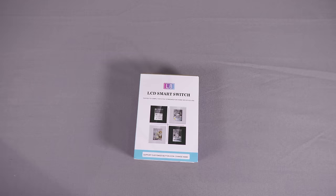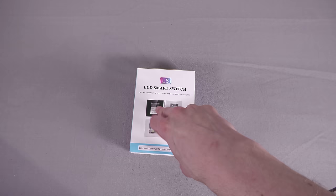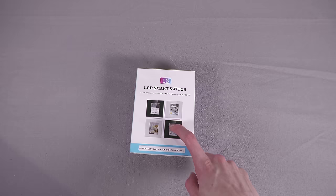However, when people make these sort of screens themselves with DIY projects, there's a piece of open source firmware designed for that called OpenHasp. OpenHasp is designed for people making their own touchscreens using their own enclosures — generally using an ESP32 microcontroller and an SPI LCD screen. It just so happens that when they designed the Lanbon L8, it also has an ESP32 microcontroller connected to an SPI touchscreen, which means OpenHasp is actually available to flash onto it.